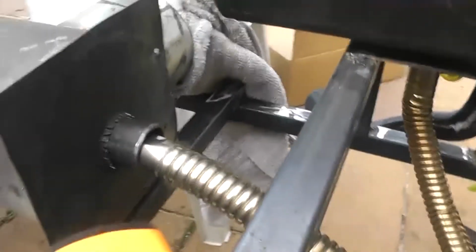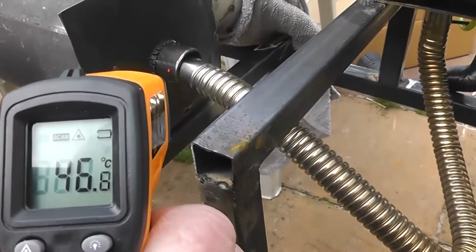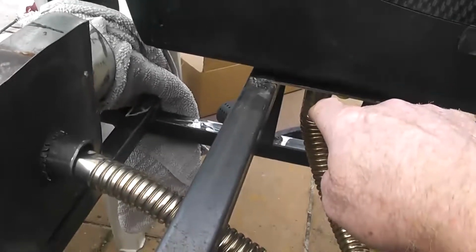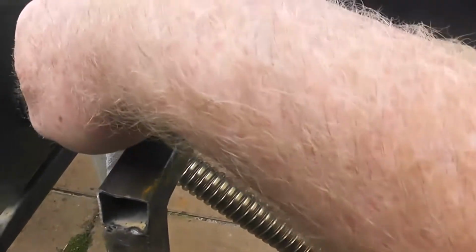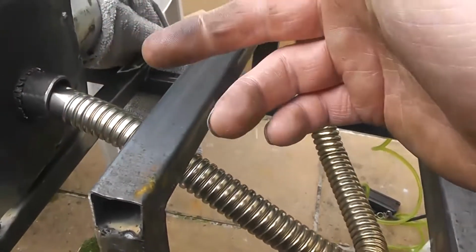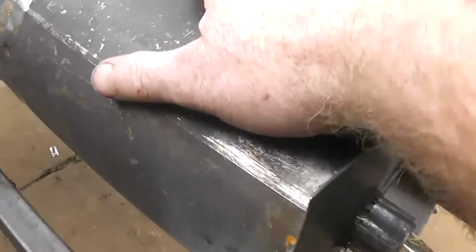So, yeah, constantly climbing. You can imagine the amount of energy being lost in this pipe. And that was the whole point of mounting this in relation to this, to close this gap from the exhaust port to the intake. And what I'll have is just one pipe coming straight over and have it totally insulated with high temperature fiberglass wrap, and then probably a secondary tube on that. But the whole point is to get the heat in here and keep it in here.